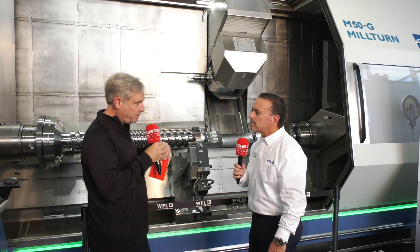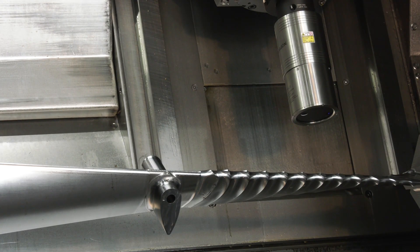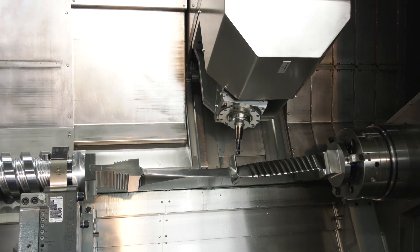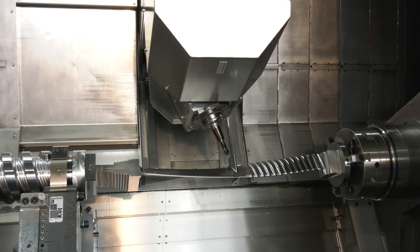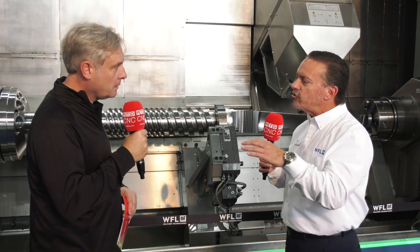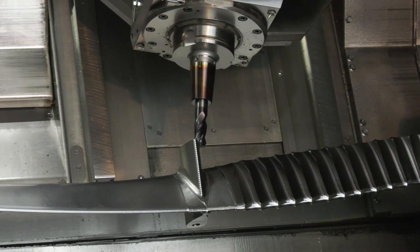The ultrasonics can actually measure even further than the 3-meter boring capacity if required. They also do laser scanning, which is a benefit because it actually takes a picture of the part and creates a 3D rendering so you can match it perfectly with the original print. You never want to transport something so big to a CMM, so they have the capacity to measure on the machine. The laser scanner produces a map of the part so you can create a 3D image and match it up with the 3D image you started from, ensuring it's perfectly balanced and accurate.